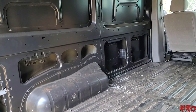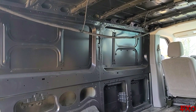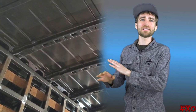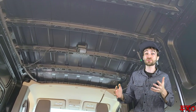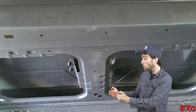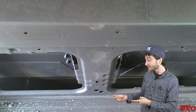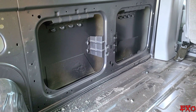On the inside, everything's still bare as can be. The walls aren't deadened, the wires aren't plumbed. It's basically just as we started. But there's a method to the madness, because the steel cage will end up completely changing both those areas. Our roof will be so tight that all the wires need to be either rerouted or removed, and our side walls are so close that good old expanding foam could seriously do the job here. Fill the voids and stop the rattles.